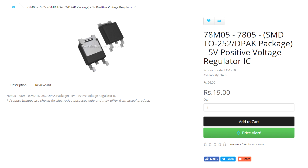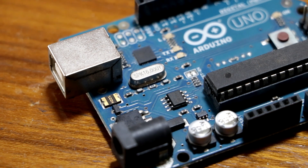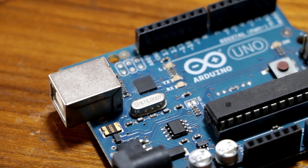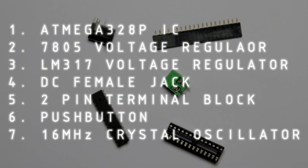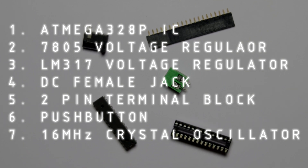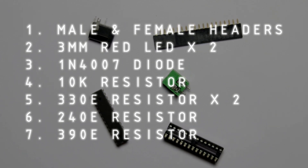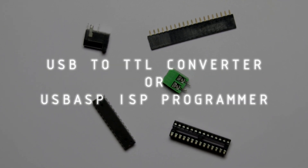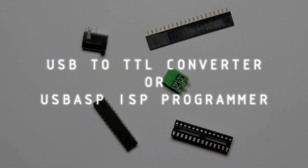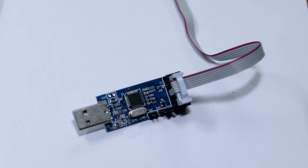For the same reason, I haven't included any FTDI chip on board for programming, so you can't directly connect the USB port of your computer to the Arduino. You will be using a separate USB-to-TTL converter to program the Arduino. Now let's look at the components you need to make this project. Gather all the components with proper quantity as instructed. The complete BOM is in the description box also. You also need a USB-to-TTL converter — also known as an FTDI breakout board. You can also use a USB-ASP converter with an SPI interface to program the Arduino.